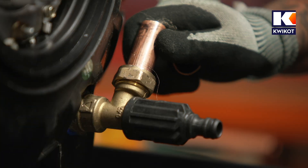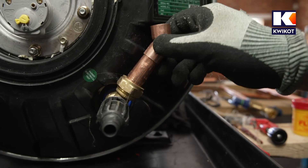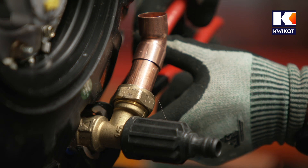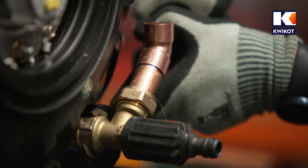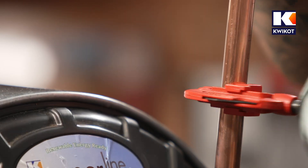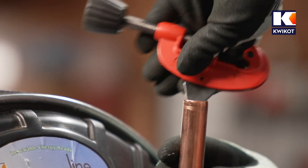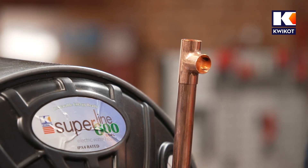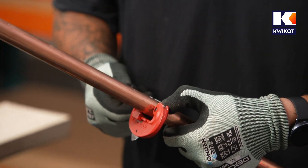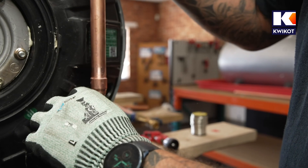First, pipe up the cold inlet of the water heater and include an anti-siphon loop. The anti-siphon loop, together with the vacuum breaker, will ensure the water heater doesn't drain if the water supply is cut off. Make sure the upper part of the pipe points straight upward, and the T-joint must be placed level with the top of the water heater. Using the adjustable pipe cutter, cut the pipe to the required length, then scrape out the burrs using the deburring side of the pipe cutter. First, cut the pipe and dry-fit the fittings without flux to ensure the lengths are correct, then check the length of the cold water pipe which runs across and connects downward to the cold water supply in the property.